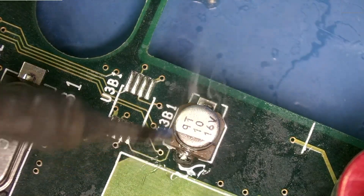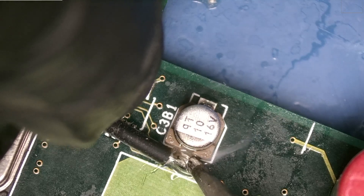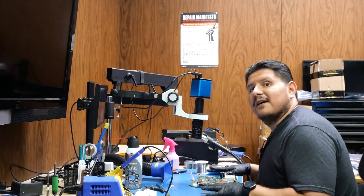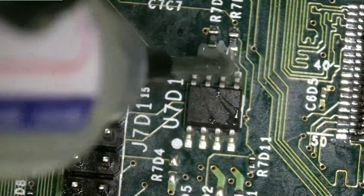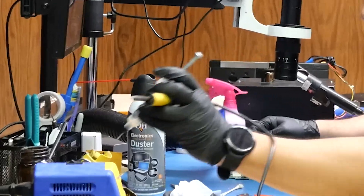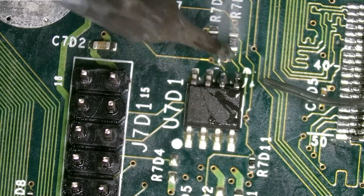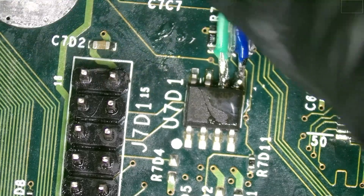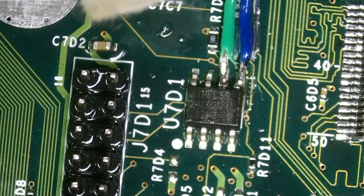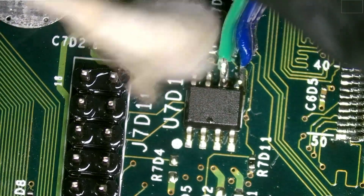We need to install our ground wire, so let's add some flux and some solder. We'll go ahead and do this righty then lefty. Next would be our SCL and SDA lines, which are of course the I2C wires. Let's go ahead and pre-tin and flux up the area — those two wires go right there side by side. Add a little bit of solder. A very strong bond. The wires are exposed a little bit more than I would want, but I think we'll be fine because it's going to be sitting off of the board.